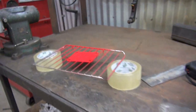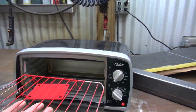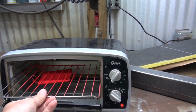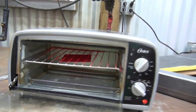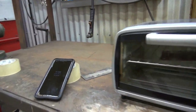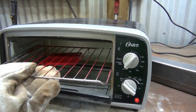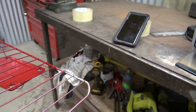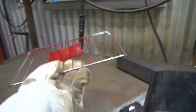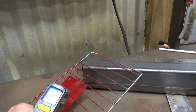For the oven test I've got it preheated to 400°F. I carefully get the part inside and bake it for about 20-25 minutes. After 30 minutes I pull it out — it looks really good. Temperature measurement reads 373 to 379°F, so it's definitely hotter than the infrared-light method.